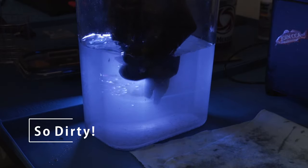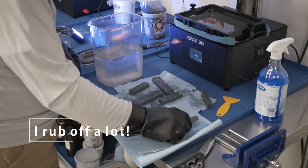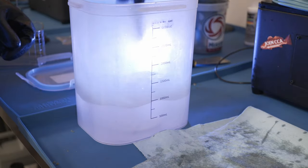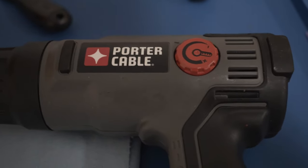My process is straightforward: I take it off the printer and wipe a lot of the excess resin off on a paper towel — Sculpt is very thick and clings to the model, so this removes quite a large amount before cleaning. I then use a two-part clean: a dirty bath where I swish and rub it for about 15 seconds, take it out and dry it, then a clean isopropyl alcohol bath for another 15–20 seconds to remove any residue from the dirty bath. I dry it off with a paper towel and let the rest evaporate, or use a heat gun or hair dryer to speed it up. You do not want it sitting in the alcohol for longer than 30 seconds — it will cause problems.